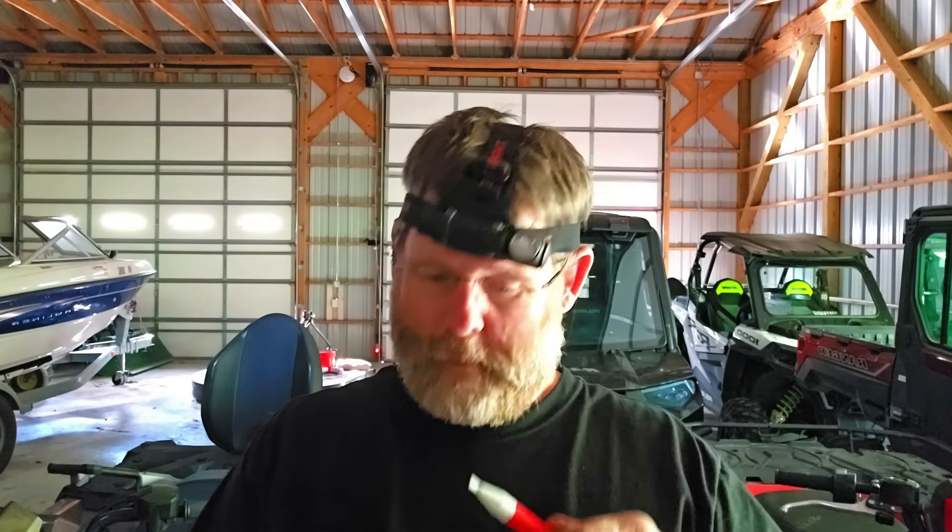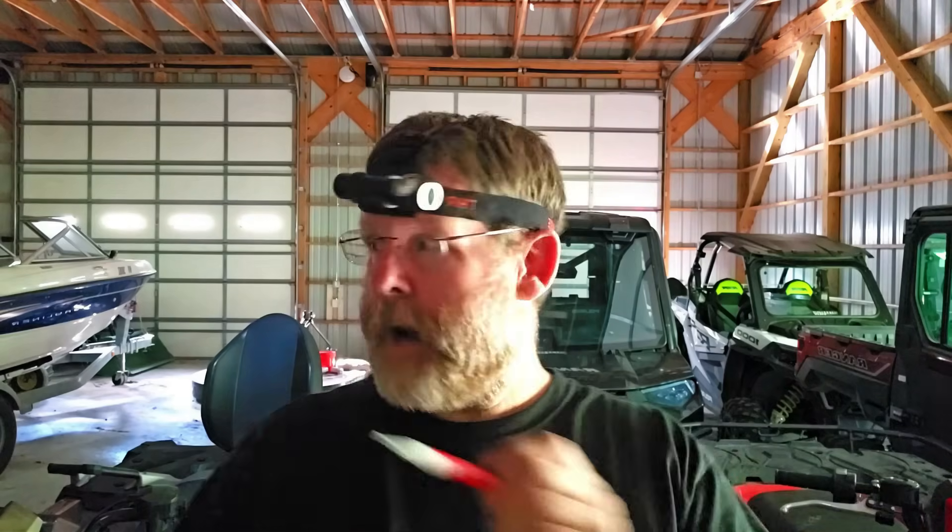Long story short on that — practice like you play, guys. Put all the screws in; it's code, for one. On every box we've done through here, I'm very redundant about putting my grounds with the ground screw. Do you have to do it? No, technically as long as you follow code you're fine. But for the boxes I've done there are ground screws in here; the ones he did have no ground screws. What happens if you lose the ground somewhere but the pipe comes loose? That's just my thing — I'm very redundant.